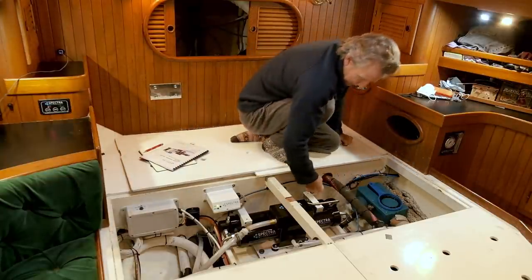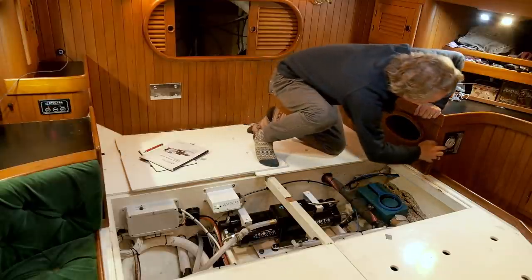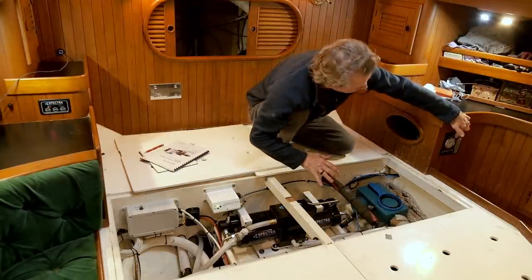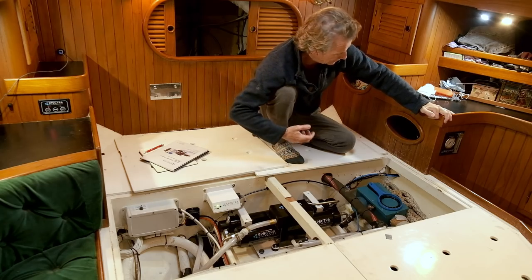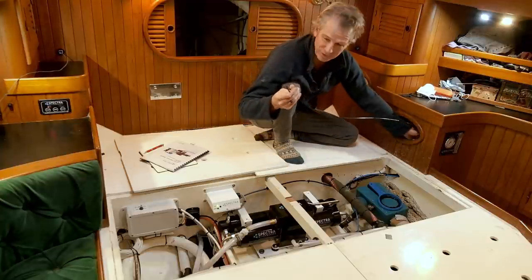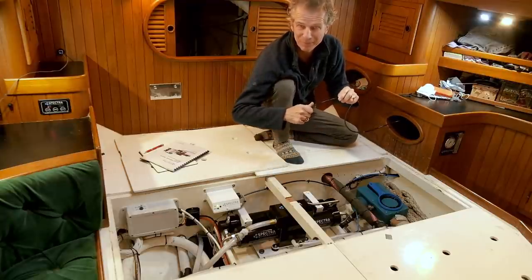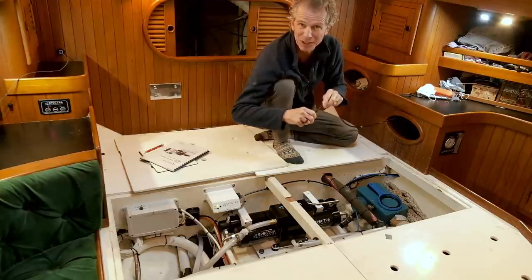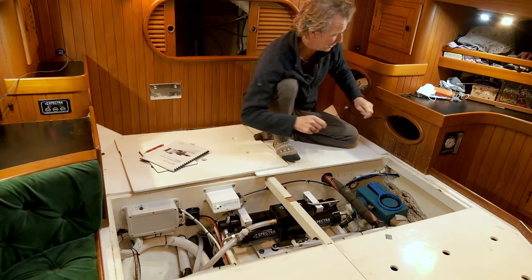The fresh water comes out through a small black pipe, with an outlet from the accumulator to smooth the flow, then through the flow meter and a pressure gauge. You can see your rate of flow and pressure. There's a little valve that either diverts the output for testing or allows it to go through to the tank. When you first start up, you put this in a cup, run some water through with a PPM meter to check the salinity level, and once it's at the right level, throw the valve to divert to the main tank.